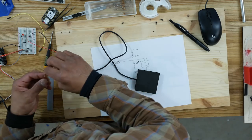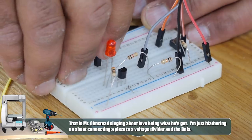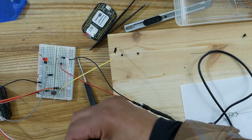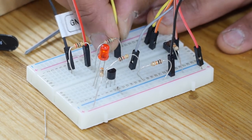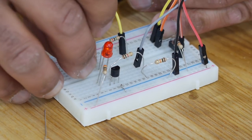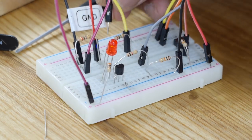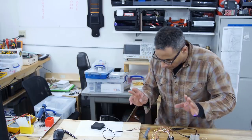I'm going to put 2 megaohms because that's what I've got, between them. I need 3.3 volts, so I need another 2 megaohms — there's my voltage divider. This goes to the 3.3 volts, and then get the ground hooked up. There's ground right over here. Now I'm going to bring the signal — A0 is going to go right there. Let's see if I can plug into there. Okay, I've got this example project loaded up — the sample piezo trigger. Let's take a look at the code.